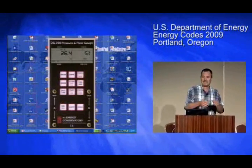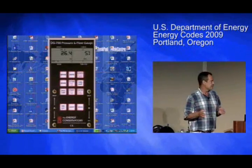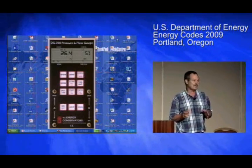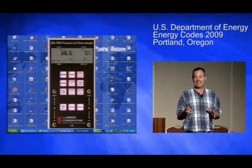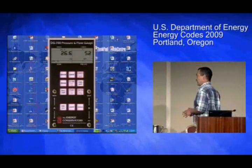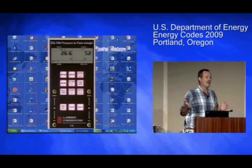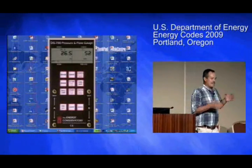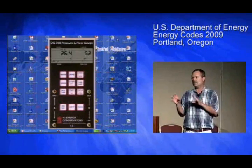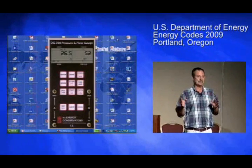Roughly speaking, our duct system here has about 50 CFM at 25 pascals. Here's the really interesting thing — I was in Idaho two weeks ago and we saw a 2,000 square foot house that had a total of 36 CFM. This box is actually pretty well taped together and we didn't go out of our way to make holes. So it's a flow rate: when I pressurize the entire duct system to 25 pascals, it leaks 52 CFM.